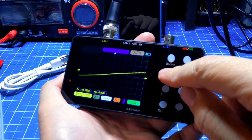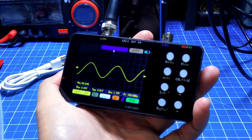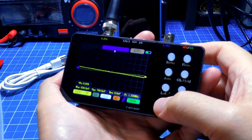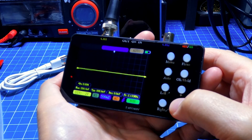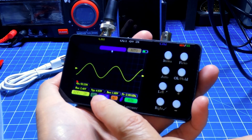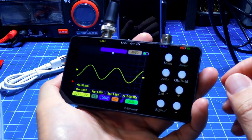I'll show this: going back to 100 kHz, pressing hold — and it goes back to measuring correctly. So from 1 MHz, the hold function no longer shows measurements. Now I will extrapolate to 2 MHz, which the manufacturer considers a valid operating range. At 2 MHz the oscilloscope is measuring: it marks the frequency, hits the VPP, hits the duty cycle. Measuring correctly.